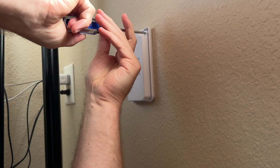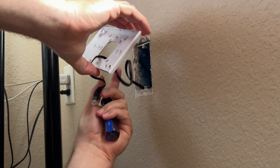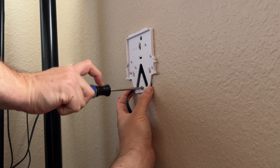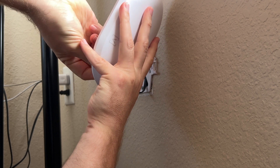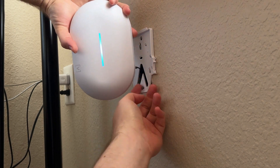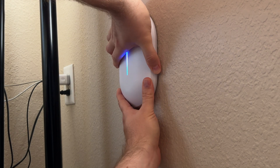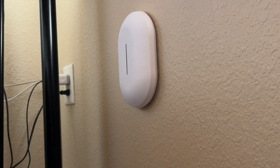This next scenario is the replacement of a Ubiquiti in-wall wireless access point with the AltaLabs AP6. The change is really straightforward: remove the existing access point to gain access to the wall box, which will have an Ethernet cable in there. All you have to do is take the bracket, attach it to the wall box, pull your Ethernet cable through, connect it to the back of the AltaLabs wireless access point, and then click that onto the bracket. Remember, this has to be PoE — Power over Ethernet — because there's no way to add power into this ecosystem other than through the Ethernet cable.